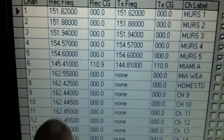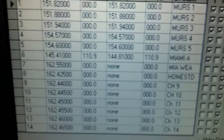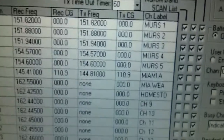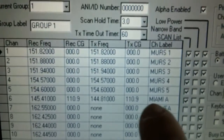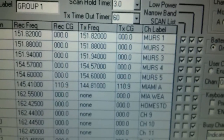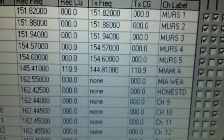Channels six, seven, and the rest up to fourteen are weather stations — no transmit, because you're not allowed to transmit on those. They just broadcast local conditions, which is valuable for knowing what's going on weather-wise, especially down there. This is geared for disaster preparation — hurricanes for his situation in Florida. He can talk to his family on channels one through five legally, and channel six is the Miami repeater for the amateur service, so if he gets an amateur license, he's already set to go.